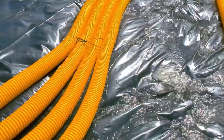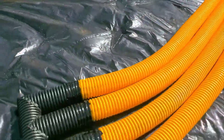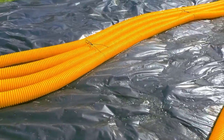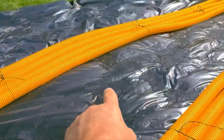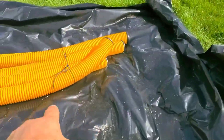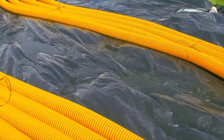This is a 25-foot leach field demonstration — we took a 100-foot coil, though I normally like 50-foot runs with two coils, but we didn't want to burn up all that material just for the demo. Hopefully this helps. Don't use a collection pipe for your leach fields — use knife cut, because that pipe disperses water. In yard drains, the water is running out here, there, and flowing all the way to the very end. That's why we use knife cut in leach fields: it disperses the water.